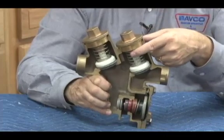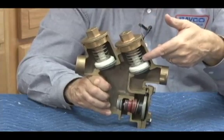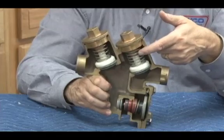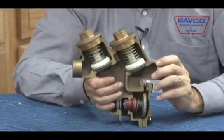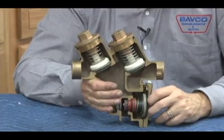So that putting that grease in there can really affect the workings of that check assembly, especially when the disc holder opens all the way up against the cap where the breather is covered into the guide. So that's important to watch, and obviously more prevalent so when the test cocks are mounted on the covers of the checks. But we covered the checks pretty much when we talked about the 40-100 series, so we won't talk about those.